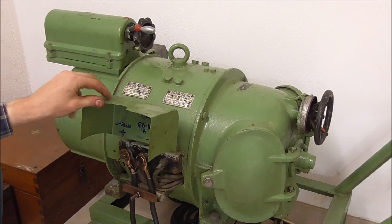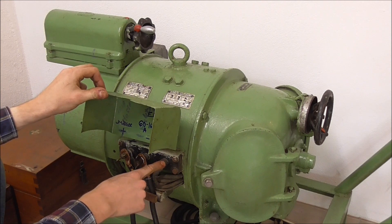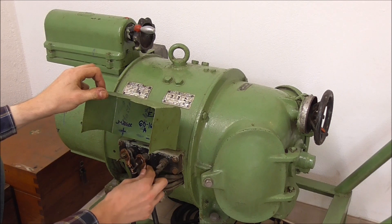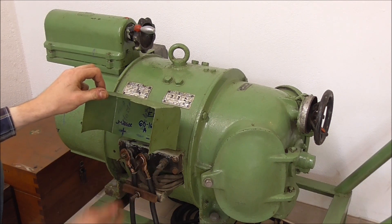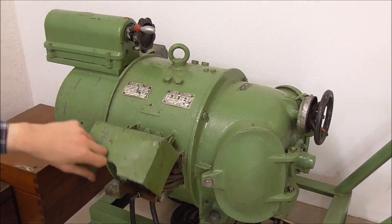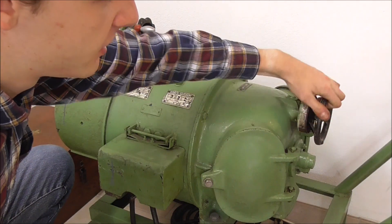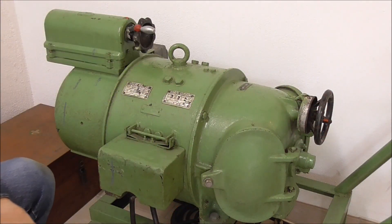You've got two sets of amperage ranges: 30 to 70 amps and 60 to 160, and you choose these by unscrewing the nut and hooking the cable to the other pin. It's 40 volts each so it's not dangerous even if you should get a zap with it, and you adjust your amperage range by adjusting the brushes on the commutator.